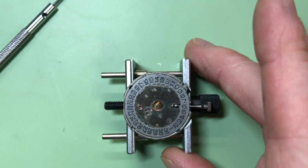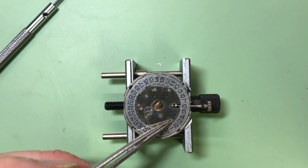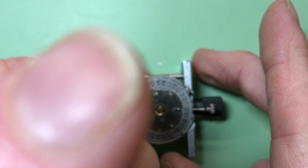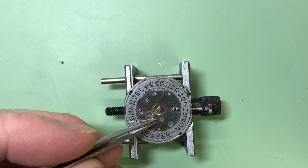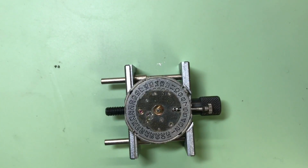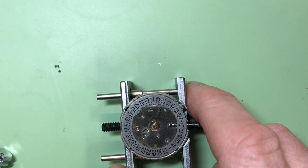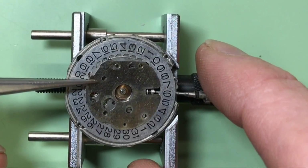Now what I also say in all my videos, certainly again if you're doing it for the first time, is to try to do 1 screw at a time. There's no rush. What I found is if you loosen all 4 screws and don't remove them first, and then you knock the movement holder, or you just knock something, these screws are so small that they are so easily lost, and unless you've got lots of parts like I have, replacing the screws will be a real pain for you. Okay, so you remove the cover like so,